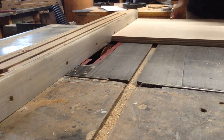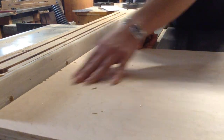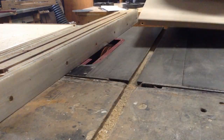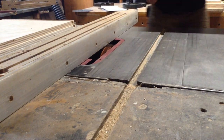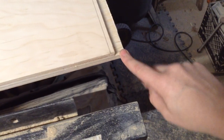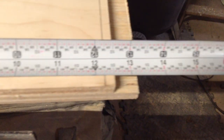You do not want the entire base sitting on your 2x10 base — it will rock. If you just have two little pressure points it reduces the likelihood of these cabinets rocking back and forth, which is why the bottom of these I always come up a little bit. Then the middle had to be perfectly in the center — I marked my face frame at an inch, marked those out, and then marked for my middle. These are a give or take about 12 and a quarter; if it's off by a sixteenth of an inch the eye won't notice, and then I cut my middle dado down the center.